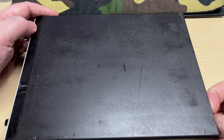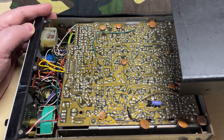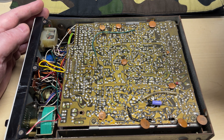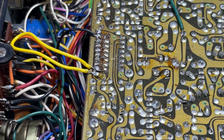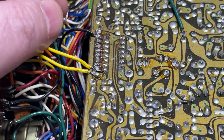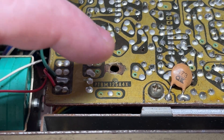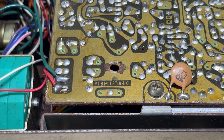The radio's had a bit of a hard life — the cabinet's a bit tatty, looks like it's been resprayed. The seller did say it had a UK EPROM in it but it's been removed, so whether it's been removed correctly is another thing. Looking at the circuit board side, I'm not sure what this is all about — we'll have to check on the schematic. Everything else around the area looks okay, and we've got a PTBM125A4X board with a strange hole next to it.